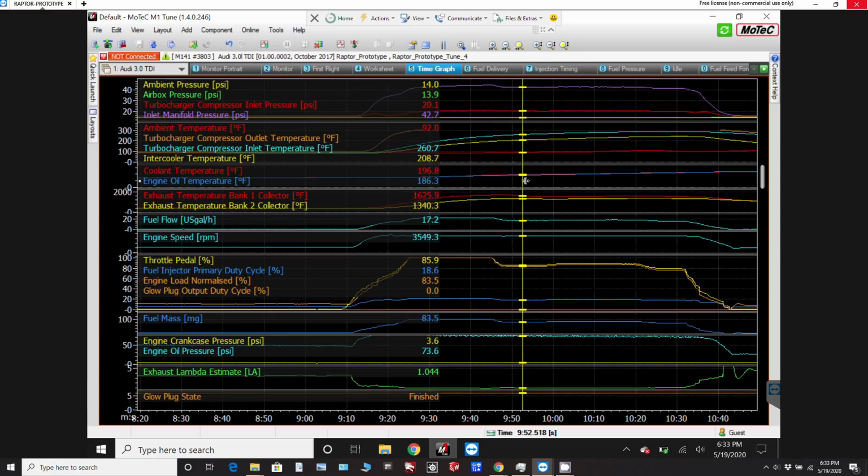And it's not going to take long with no fresh air coming in there before it's going to peak out. So I was watching there for about 225 on both of those, at which point I wanted to throttle back. You can see here I went all the way down to about here, and I actually throttled back a little bit more because the EGTs, or the turbine inlet temperature, was going up over 1600 again. So I throttled back a little bit more, about 80%. And then it wasn't long, and I had 225 on the temperatures there. So that's when I throttled back.